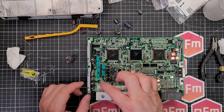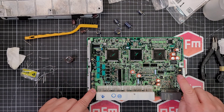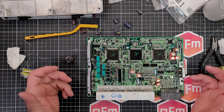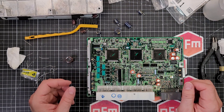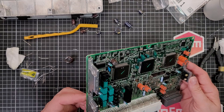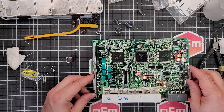Before I put this last one in, while I've got access, I'm going to take these screws out for these MOSFETs and transistors and just lift them away slightly to put some thermal grease behind - just for good measure while I'm in here. Get the heat out of these things and ensure they're going to be a little bit more reliable. They've been fantastically reliable being a Toyota and well designed, but it can't hurt to put a little bit of thermal grease behind there to keep things as cool as possible.